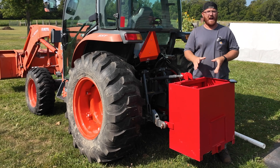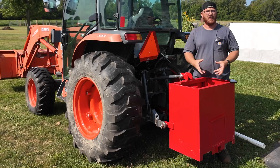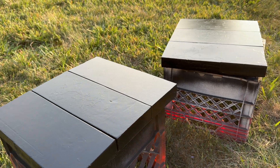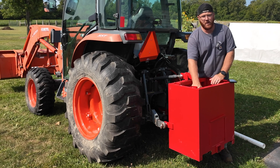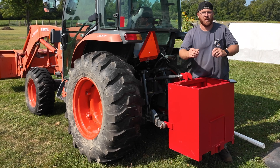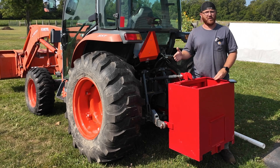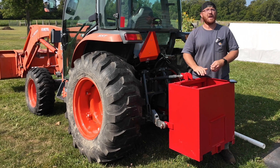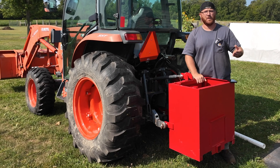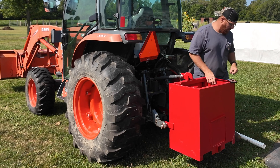The concept I came up with was taking nine of those plates and stacking three of them across to make a wall, then putting a lid on top. I'll weld those in place — that makes the walls for the storage compartment — and then encase it in concrete. I want the concrete to stop short of the top so I can store stuff up there as well. I'm shooting for around the 600 pound mark, keeping in mind the box is rated at 800 pounds, and I want to leave wiggle room since this has a two-inch receiver in front for towing trailers.